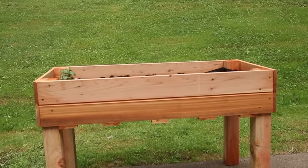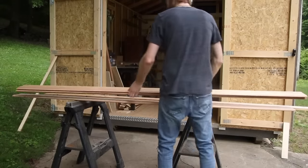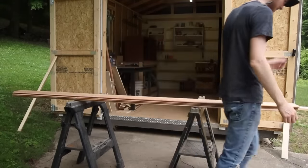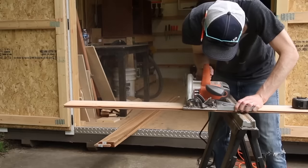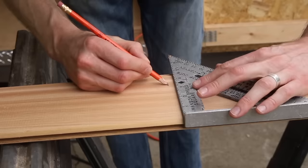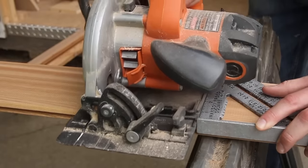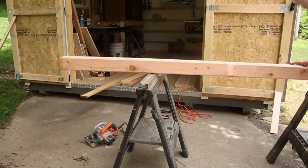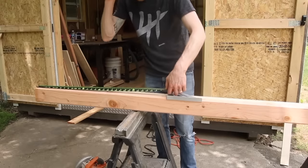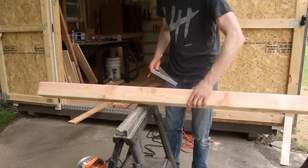I've been wanting to make this planter box for a while now, and now that it's officially gardening season where I live, I figured it was time to jump on it. For this project I'm using one by six cedar boards — these are actually tongue and groove paneling boards — and the reason I chose cedar was because it resists water a lot better and doesn't rot. For the 4x4 posts for the legs I did use Douglas fir. This will rot, but I figured I could just change it out after a few years if it's getting too bad.